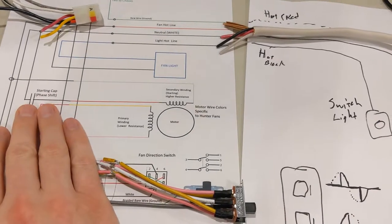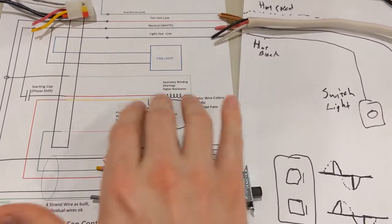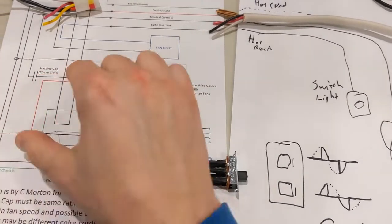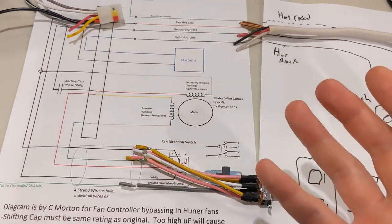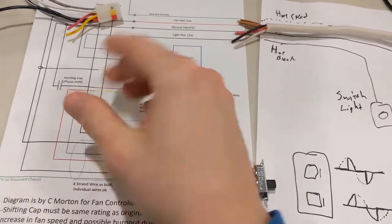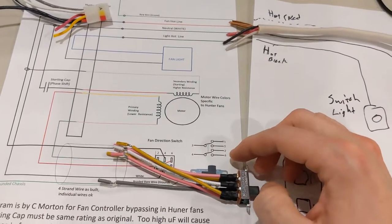This capacitor has to be at least the same or less. If it's less, it's going to be a slower rotating fan at max speed. If you just look at the biggest cap inside your controller, that's typically what it's going to be. They may also have a dampening resistor in there so it doesn't have as high a kick-on current.